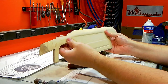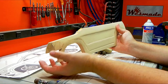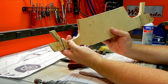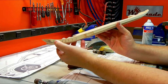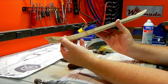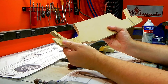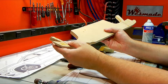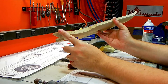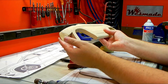The front and the back obviously are tapered in, so instead of trying to build that up with extra wood and then just sanding it back down, what I've done is I've taken the bandsaw and made relief cuts. You can see those cuts successively along the length. Open the cut up a little bit, fill it full of super glue, close it back up, and then just keep progressing along until you get a nice sweeping bend. You can come back on the front and sand that down.